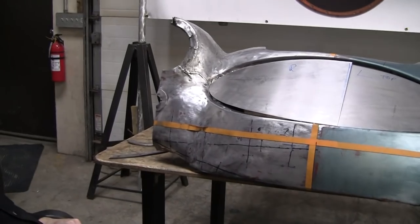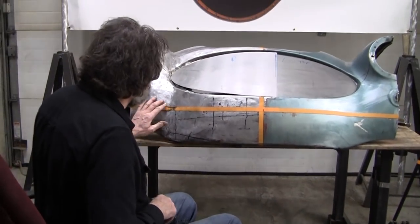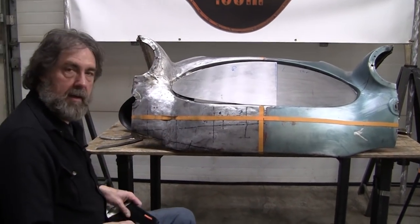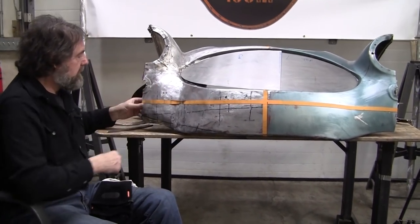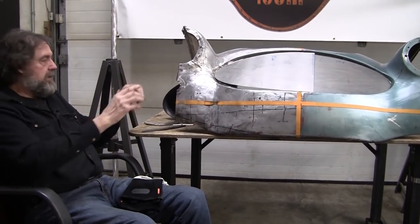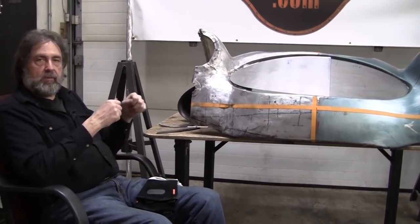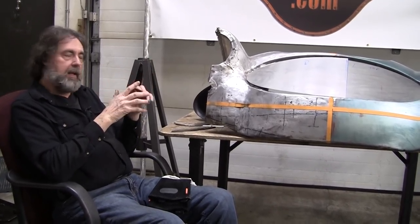As you've been watching this video, there's a lot to it. And we're saving this really nice, and I'm happy with the way it came out. The weld is super solid, and it's nice to have it all as one entity. Now we can hammer it and slapper it and wheel it and planish it with the planish hammer. Whatever we want to do, and it's going to stay together.